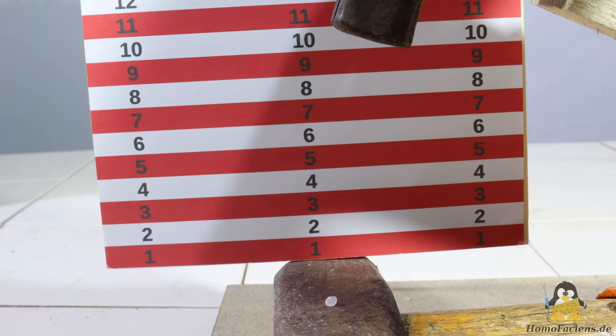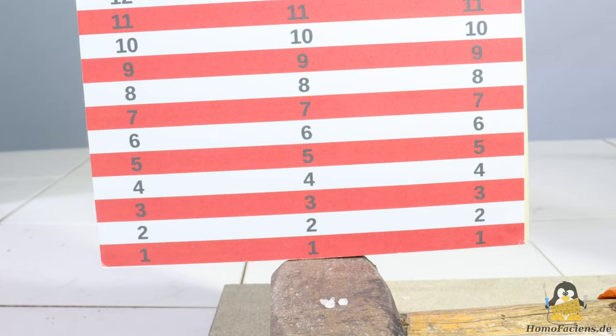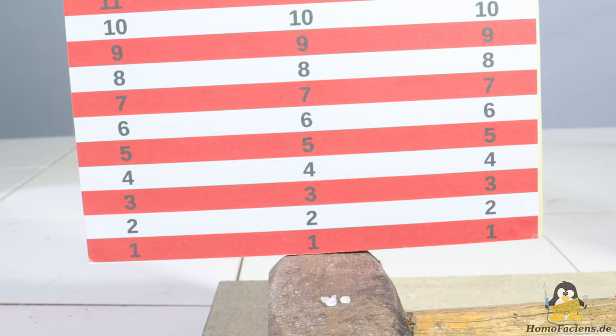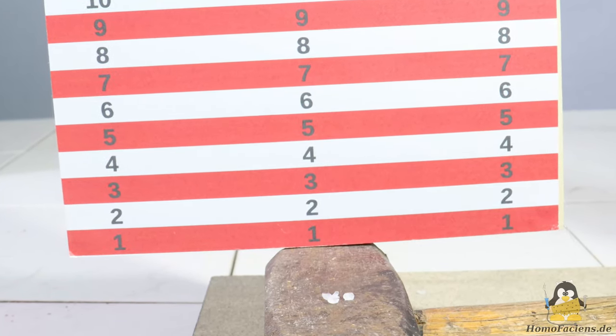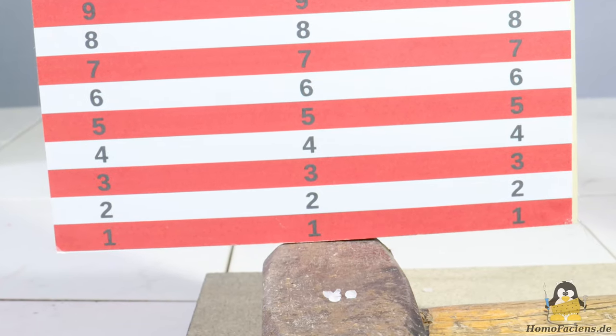The hammer has to be dropped from a height of around 10cm to smash a PLA pellet — 5 to 10 times the amount of energy is required to shred PLA. Different processes occur when grinding than when hammering, which means crushing the plastic with high pressure or shear forces.